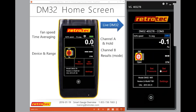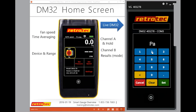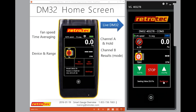So I'm going to do a quick test here. I can do set speed or set pressure. I'm going to follow what most people have, and that is set speed and 25. You may hear the fan I've got underneath my desk. It's going to kick on. So I can now tap different pascals, I can jog up or down 5 pascals. Some people want to do more of a multi-point reading, so you can do that fairly quickly on here and write your numbers down. You can press hold if you need to get them as you reach those test pressures.